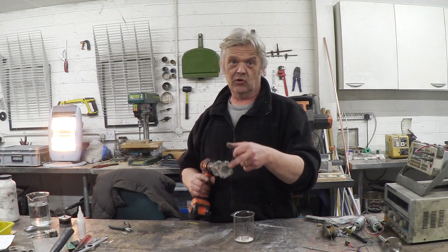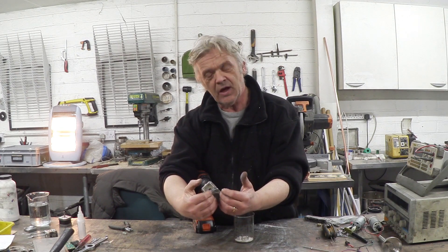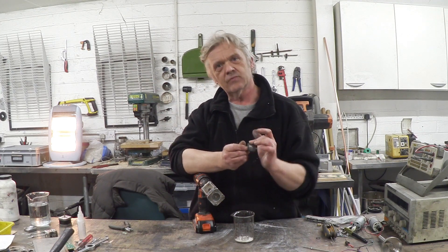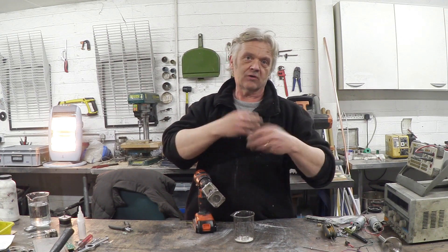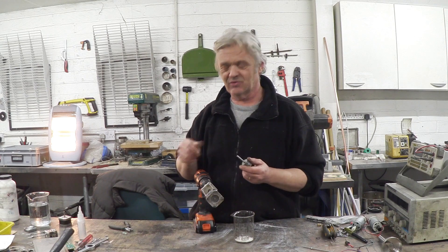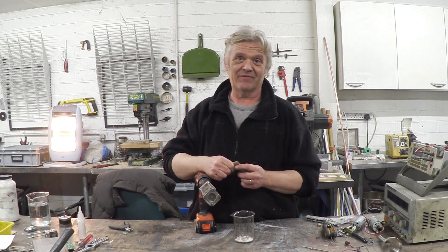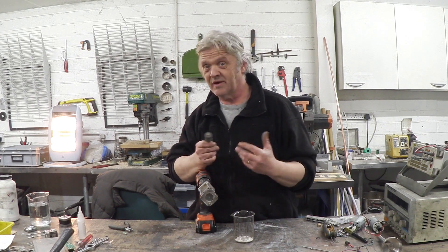The idea is the liquid gets sucked up in there, and because we've got all those little teeth on the rotor, it gets caught between the teeth of the rotor and the inside of the stator, thrown to the edge, ground around a little bit, and then forced out of these holes at the side. Now we should be able to run this at 10,000 RPM — I mean, I've got it on a drill doing about 700 right now — but 10,000 RPM is what makes it a high shear mixer.